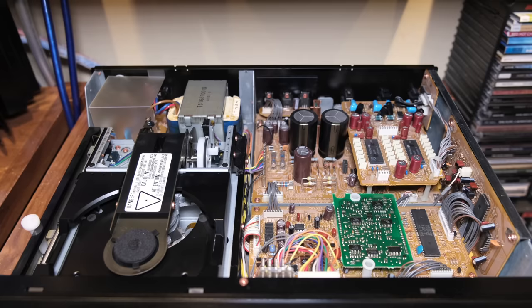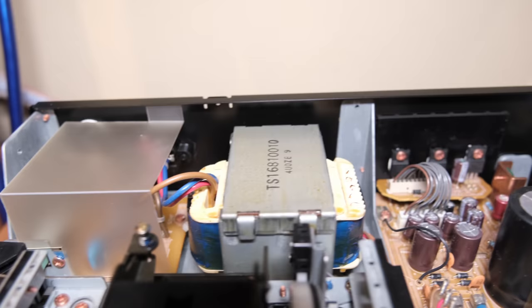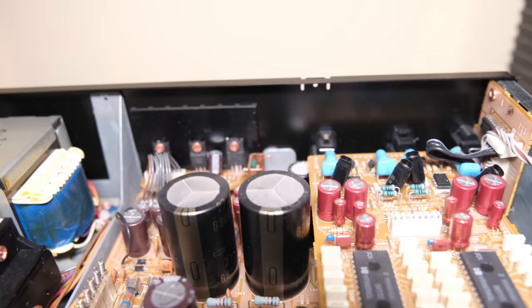I actually already told you a lot about the single crown TDA 1541A DAC, the ladder DAC from Philips, which, once again, a lot of people are going crazy for this, and they are disassembling them from these units, and they're trying to put them in other units, or they're modifying this model, the CD-94 Mark II, and introducing more new stuff. A lot of mods, taking away the oversampling, because unfortunately they did oversampling in these models. Trying to bypass the oversampling, trying to change a few of the capacitors, and all different little mods to upgrade and bring this even to a higher level.